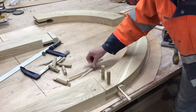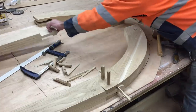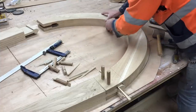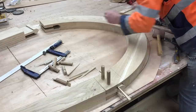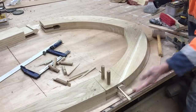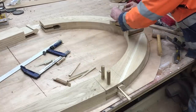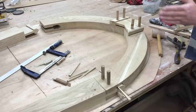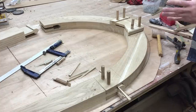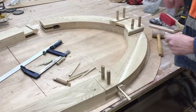Like I say, a hammerhead tenon, and at the top's a little different. The top you put together with a thing called a loose key. That's the loose key, similar to this. So I'll mortise that next, send that through. And to make sure it's there forever, I'll put four dowels. So that'll be that. That's the outer frame of the actual door. I'll put that together, then I'll put in the lock, rail and sill, and I'll come back then.